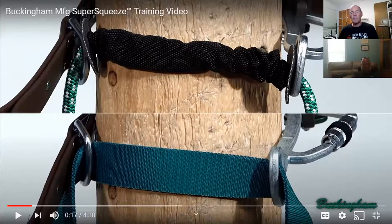It is a little bit easier to flip up and down the pole because you have a smaller surface making the grab. But I've also heard some guys say it does slip a little bit — a couple inches. I don't like to slip at all. It kind of rolls before it stops you, whereas the bottom thick strap is an immediate choke. If you have a cutout or a fall, that's immediately going to catch you on the pole. That's why I like to use those a little bit better. The bottom one is also, in my opinion, a little bit more durable — you get more lifetime out of it.